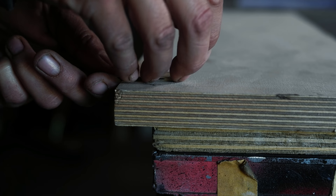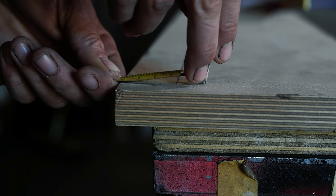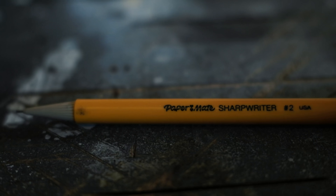A very useful tip for marking things is to use either the tape measure or the wooden ruler as a marking gauge. You just use your finger as a stop lock, hook the pencil to the tip, and ride the factory edge to draw a straight line. I use it all the time — it's easier with the wooden ruler, but with some practice it's also doable with the tape measure.